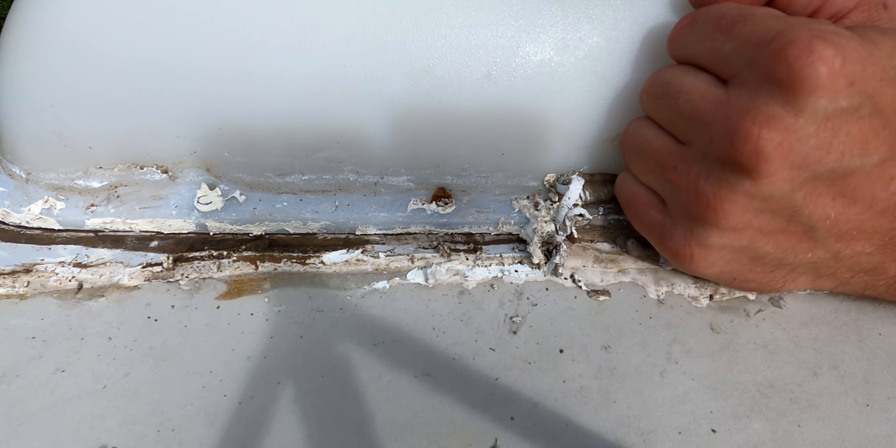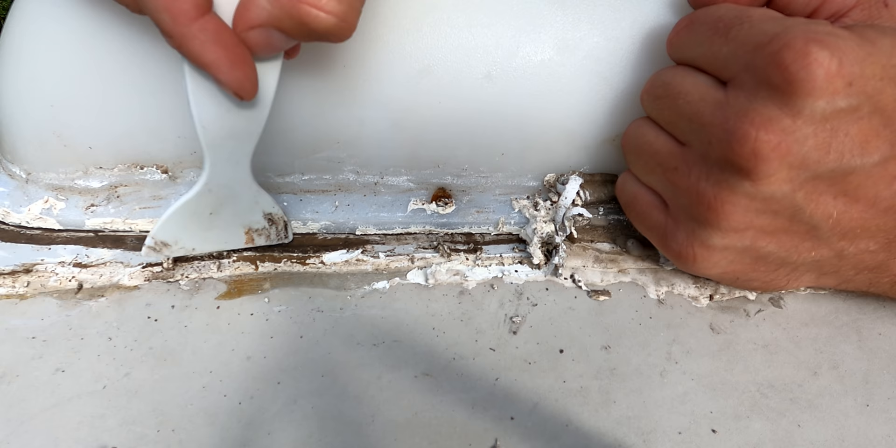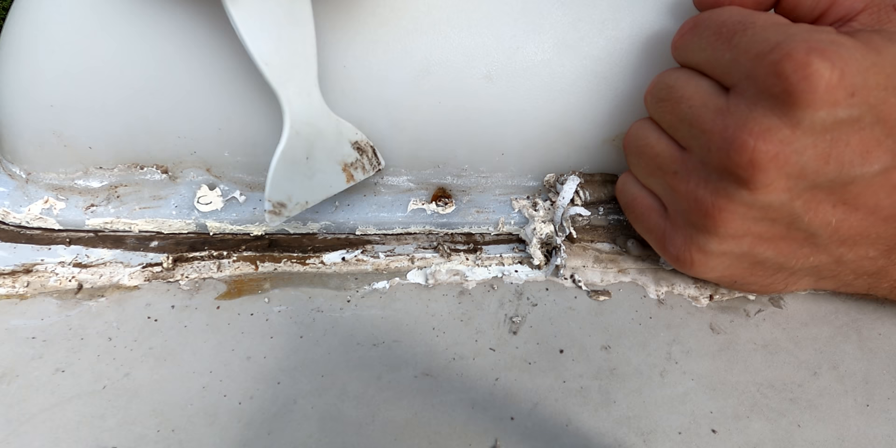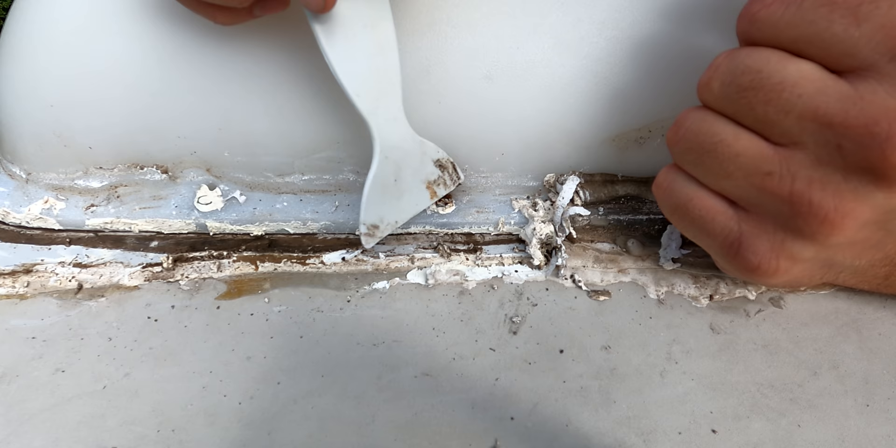Here I have a sneaking suspicion where the leak probably was. As you can see, these dark spots right here — there's been water getting in there because there's dirt and a mark showing that it's been wet. Also, there are some screws right here that are rusted. That obviously tells you water has been getting in through there. So we're going to go ahead and make sure we clean this up and get it nicely sealed.